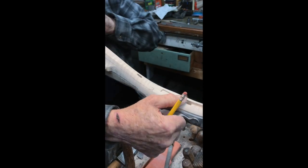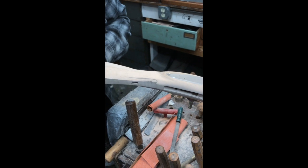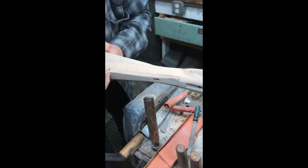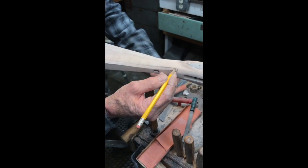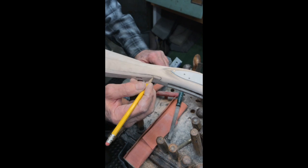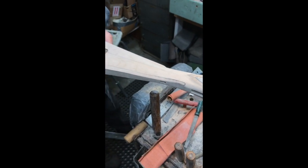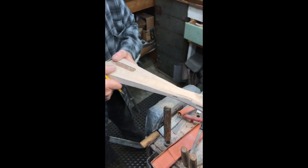If you come over here, you'll see I'm trying to emphasize the use of the light. It doesn't look too bad when you're looking straight on, but when you put the light over here at an angle you can really see everything. I keep harping on the sharp chisels, but I want to say the same thing about your sandpaper also. That's one of those wormholes right there — let's see if I can eliminate that. Sometimes if you get down in there, it gets bigger instead of smaller. That one's pretty much staying the same. Put my molding mark back on here. These moldings are the easiest thing to do, and they make such a big difference on a rifle.